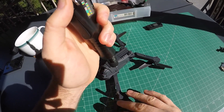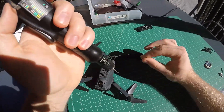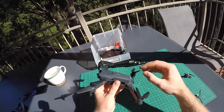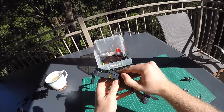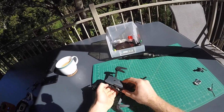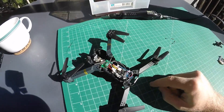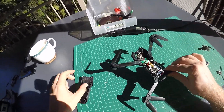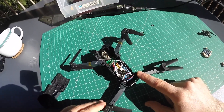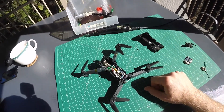Let's speed up the footage a little bit. Once you have removed all screws, you can pry the top half off by just pulling where the arms join the body — that's where there are little pins sticking from the top half into the arms. Those two pins are sticking in those holes that hold the swivel arms in place. There are rubber o-rings between the arms and the upper body but I keep losing them and it doesn't really seem to have much effect, so don't bother about them.